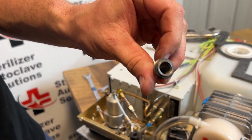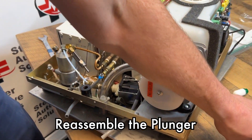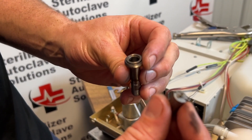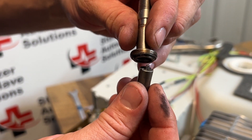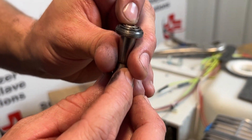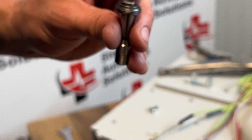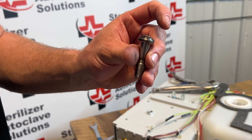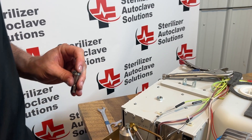We want it nice and shiny on the inside. What we are looking for is this plunger to move freely. I'm going to put the spring back inside the plunger, put the plunger in, flip it upside down — and this should move up and down rather freely. If it does not, you could have a bad stem, a bad plunger, or a bad spring. At that point, give us a call and we can figure out exactly what you need.